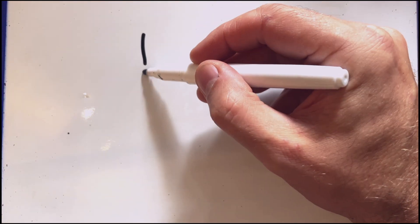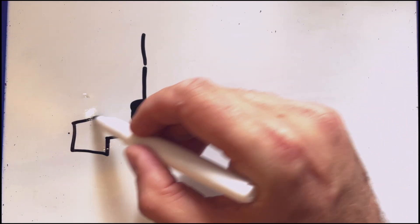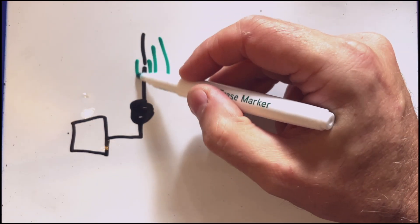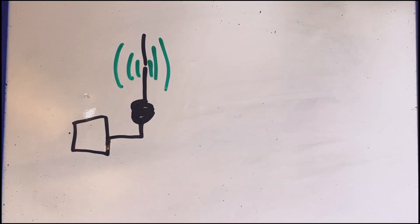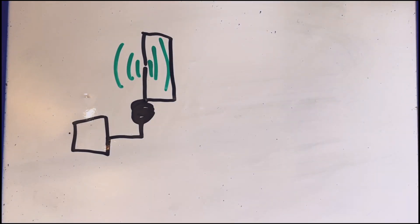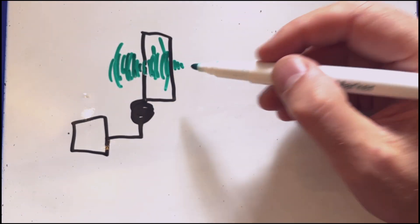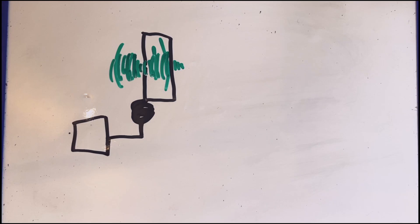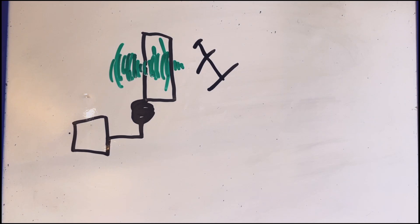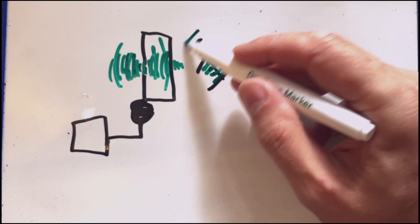So we've got our coax antenna, there's our coil to choke off the RF signal and then this goes to the transceiver. The RF is radiating out this way. And what we're going to do is basically build a reflector there, so the RF hits that, goes back and strengthens that way and is reduced that way. A bit like a Yagi, where you've got a reflector, your driven element and a director, and the RF is coming this way, hitting that and going back that way and getting stronger.